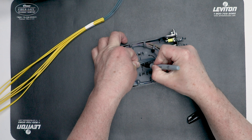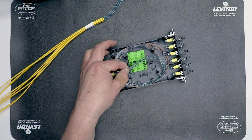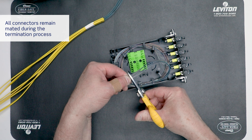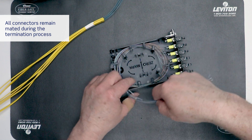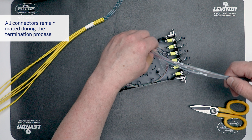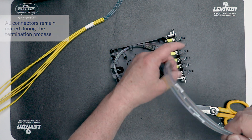Mark the fiber at the zero mark guide and remove all fibers from the storage area. As an option, route all fibers through the splice sleeve holder area and cut after exiting one half inch past the far end of the holder. When using this method, mark the fiber 30 millimeters back from the end for positioning in the fiber holder.